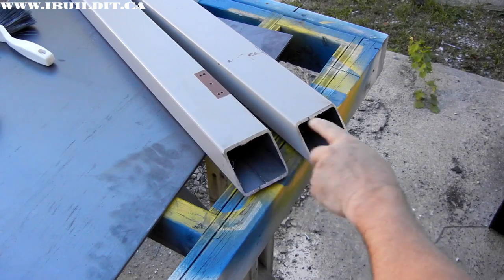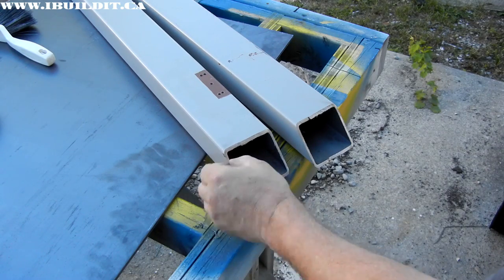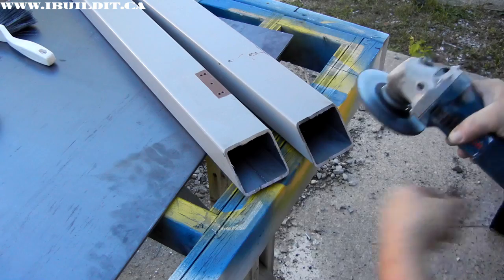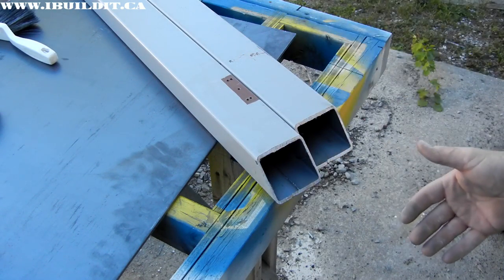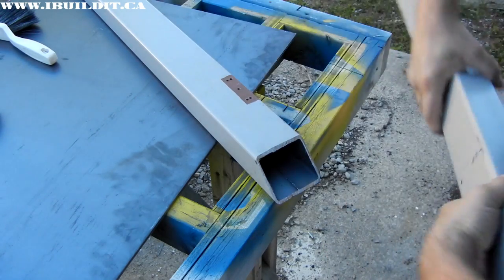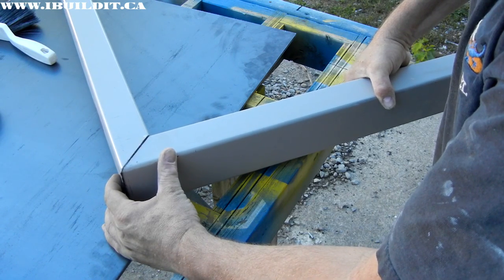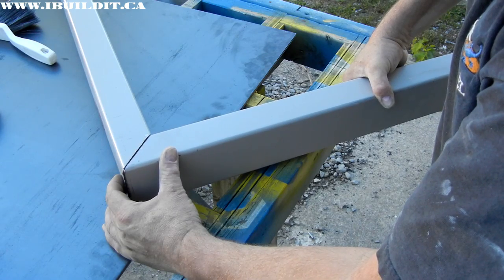I've got a little bit to clean up on each cut. These don't have to be 100% perfect — they should be very close to 45 degrees so that the thing goes together correctly, so I'll just grind these off. Cutting it in half like that creates two of the bevels that I need. The top is made up of a total of four pieces and they're going to go together like this. When I'm putting them together I'm going to have a small gap there to weld.